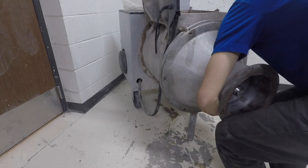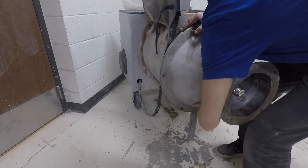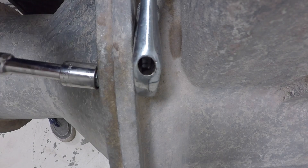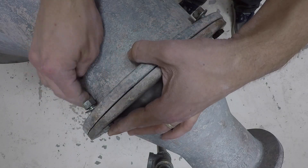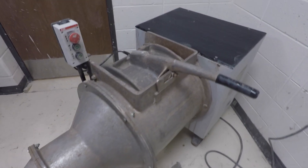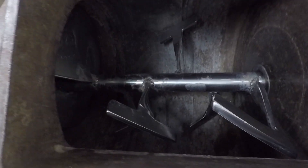When it's time to reattach the nozzle, be gentle and don't bump or bend the auger. Leave all the nuts and bolts loose until they're all fit, then finish it up with the ratchet and the wrench. While you're at it, wipe down the outside — and take a picture because it'll never be this clean again. I promise you.